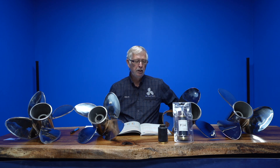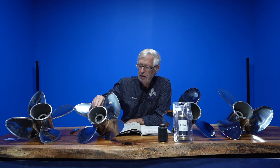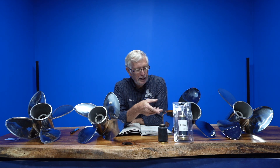The E-group that we fondly refer to is really the large gear case of four and three-quarter inch, 15-spline. It's been out there for years and years and there is quite a bit of interchangeability on those shafts. We always run the new interchangeable hub systems, which means that propellers like this can be used on different brands of outboards by just choosing the correct F-number or the correct hub kit for that particular propeller.